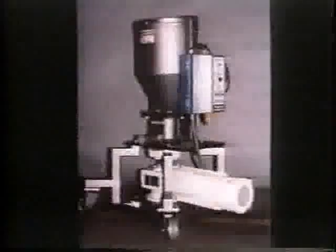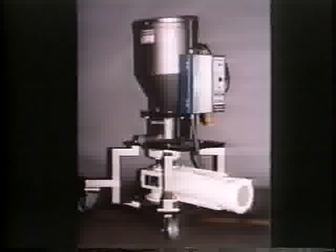With High-Vis pumps, such an auxiliary pump feeder will no longer be needed. The High-Vis pump is a two-stage pump: the first stage is an NPSH builder, and the second stage is a regular twin-screw positive displacement pump. The first stage augers drill into the product and pull it inside the screw pump cavities. Once the product is inside, the pump has no problem pushing it out and developing the necessary pressure. The drive is located below the pump and drives both stages together.